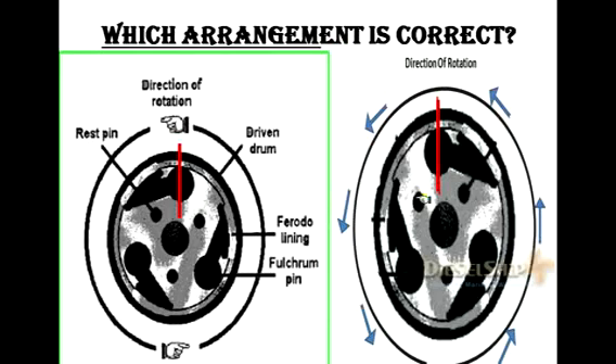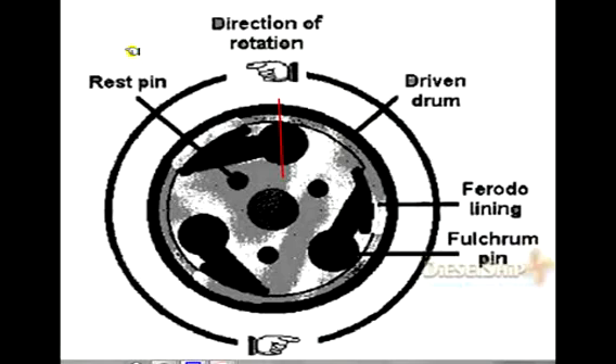The picture on the left — with the clutch pads forward of the axis — is the correct arrangement. Most people are not aware of this and always think the shoe pads trail the axis with anti-clockwise rotation. That is not the case. The pads are always forward of the axis so that friction can bring the purifier horizontal shaft up to rated speed.